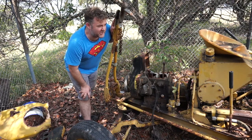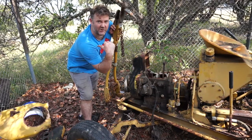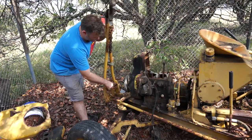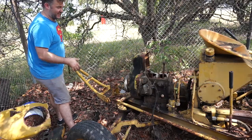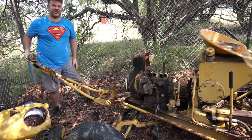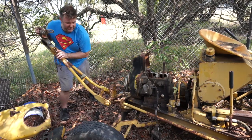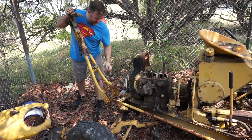One thing these were able to do is you could actually tow them behind a car or truck, where they would be towed in reverse. You would disengage the front wheel drive, and because it steered with the back wheels, what you did was pull out this pin and drop this tow hitch down. As you went around a corner, the tow hitch would steer the wheels. The wheels do actually appear to be moving quite nicely and freely, and the steering lever's moving with it. So that's good.